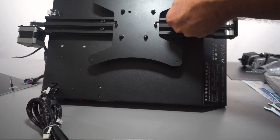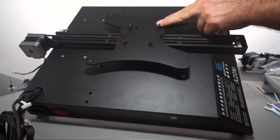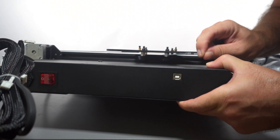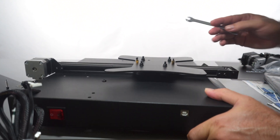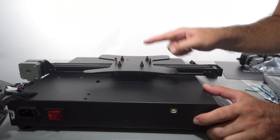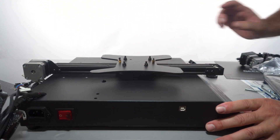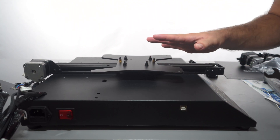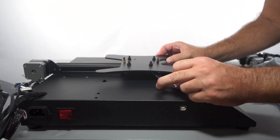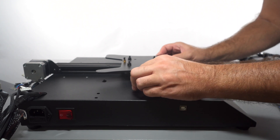They're relatively tight but can be tighter. Now we can adjust the rollers underneath — two rollers are not adjustable and two are adjustable. It's as simple as taking a wrench and turning the little eccentric nut until the wheel gets closer to the rail. This process is tricky because you can't access the bolt from the bottom to hold it still, so I'll just adjust them where they are — going until I hit resistance, then pulling back.